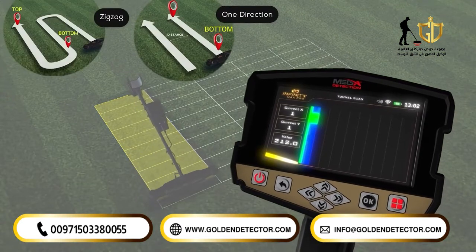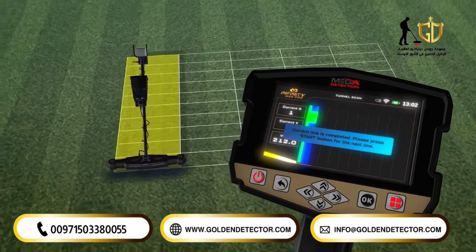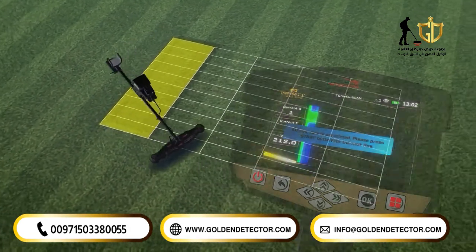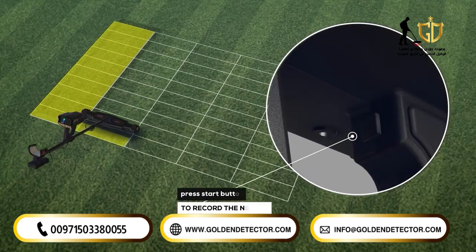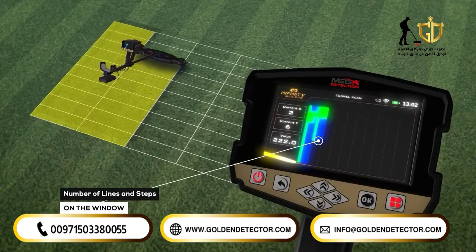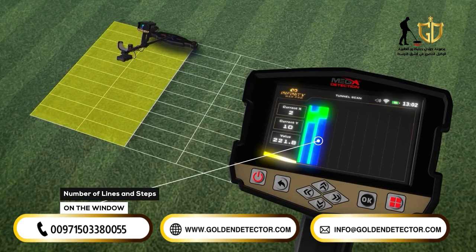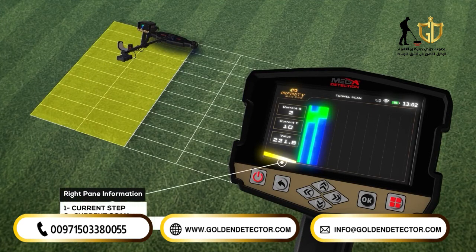One direction or zigzag. After each line of the scanning process is completed, you'll see an alert on the screen, which means you have to start a new scan line. Change your position to the beginning of the next line and then press the Start button located under the handle of the device. On the screen appears a window that includes a grid of cells according to the number of lines and steps previously set. In the right pane, you can see information about the current step, current scan line, and numeric value of the probe during the scanning process.